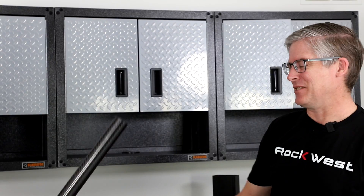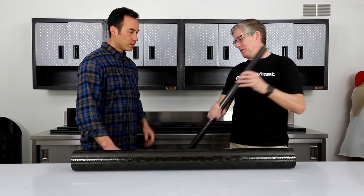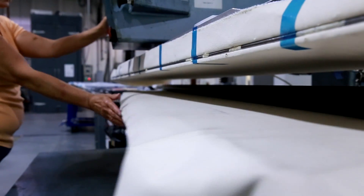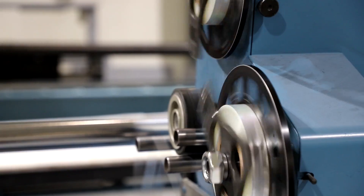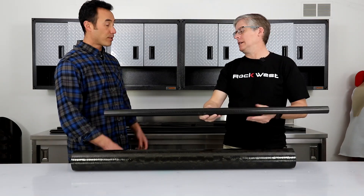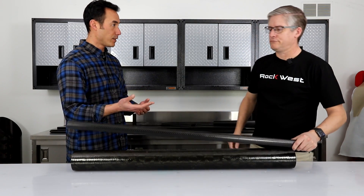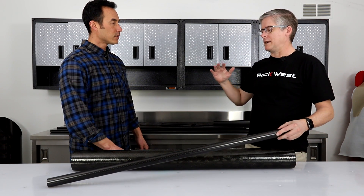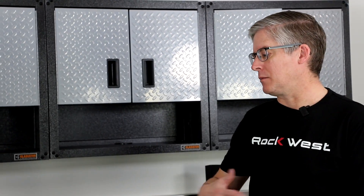So we talked about roll wrapping, and that's a machine wrap where the material is pre-preg. It's wrapped around the length of the tube, then we put a shrink tape around it and cure it, and we just add layers upon layers to get a tube. Pre-preg is almost like a wallpaper material — it's cloth or fabric with resin already in it.